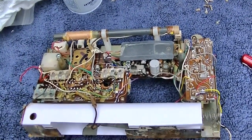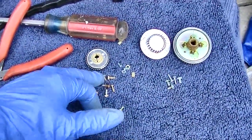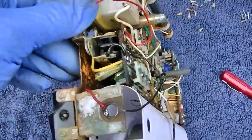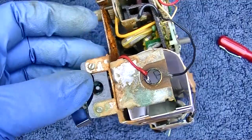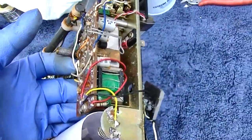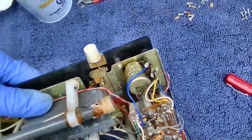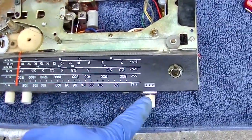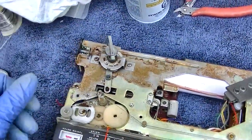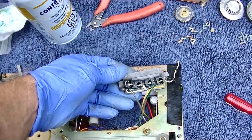You can see that works. I cleaned up this, took this plastic off, cleaned everything with a wire brush. I disabled this external power plug and ran the wire straight from the power switch to the battery. I cleaned up everything. I checked all the capacitors with the capacitor wizard and they're all decent — no high ESR capacitors. Whatever was shorted and causing the high current draw before has reformed. Now I'm just slowly sorting all these corroded screws out.